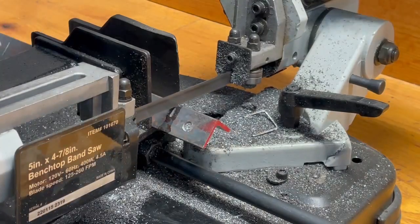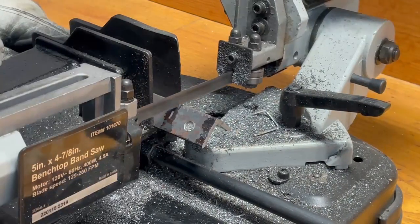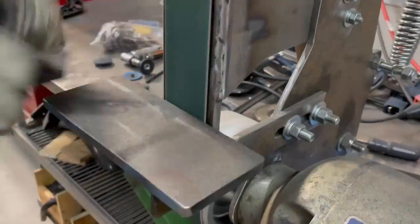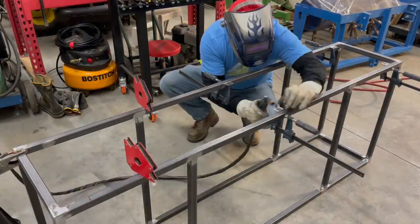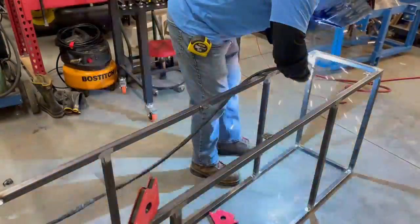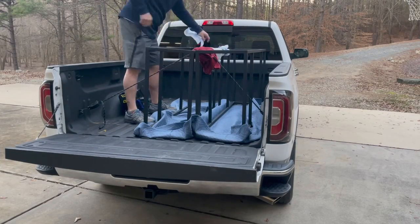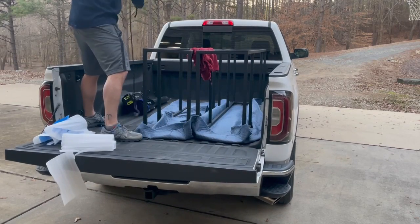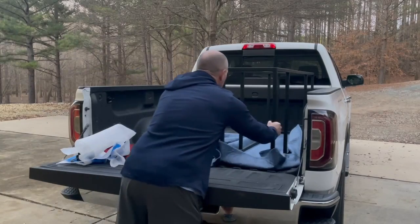Right here I'm making a bunch of welding tabs that I then welded to the frame. The idea was to use these as bolt holes — where the bolts would go through the frame and into the tabletop to hold it all together. I'm going to leave this in the video, but I ended up not using these tabs. I welded them on, didn't like it, and cut them right back off. Then I took the whole thing to the powder coating guy I use. When I brought it back, I ended up just drilling holes directly through the frame for the bolts — made for a cleaner look. Through the magic of video, I drop them in the truck and two-and-a-half weeks later they come back from the powder coating place, all done with a durable flat black finish, ready to go on the tables.